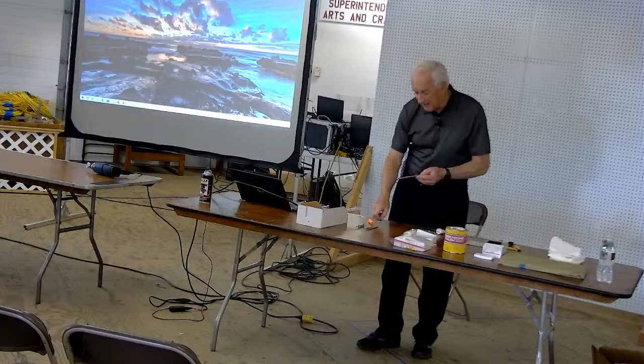This is an aluminum cover off a VFO on a Valiant, and it's usually my signature. If you see a Valiant or Ranger that's been restored and you see a polished VFO cover, it's probably one I did. I take the VFO cover off anyway to do what I need to do to restore it. I put it on a buffing wheel with some buffing rouge and it really comes out nice, but you can also do it by hand using a product called Simichrome, available online and probably at auto parts stores.